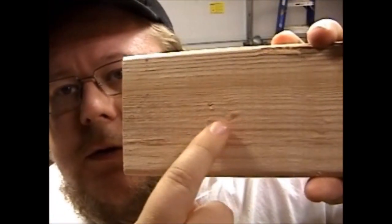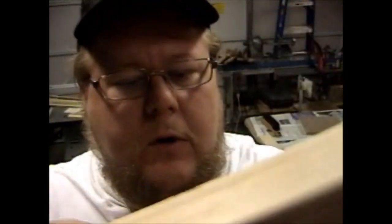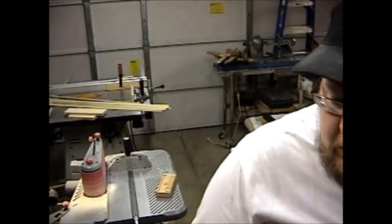There are some blemishes on the wood, tool marks from something, and where they rounded the corners off, it's starting to tear away a little bit. So what I think I'm going to do is hit all these cornered edges or radiused edges on the router table with a 1/4 round bit and go from there. Not going to give it the rustic rough look. It's going to be more of a finished look, but at this point I don't want people getting splinters. Right? Right.